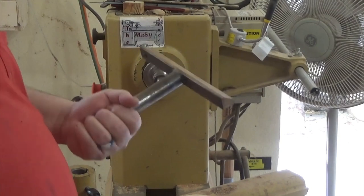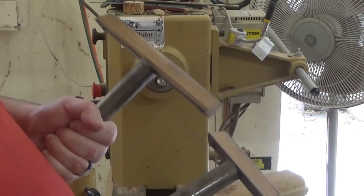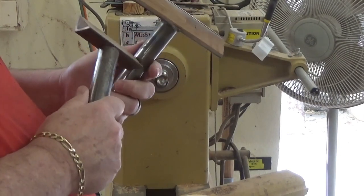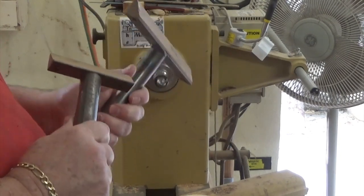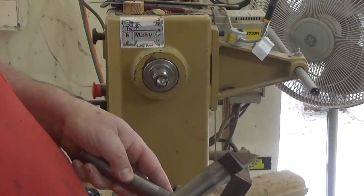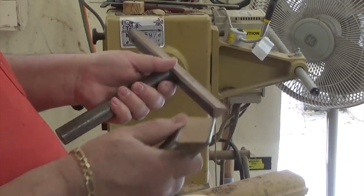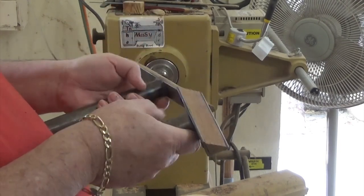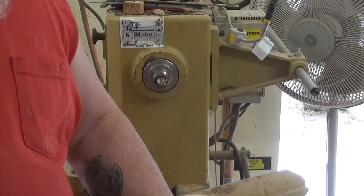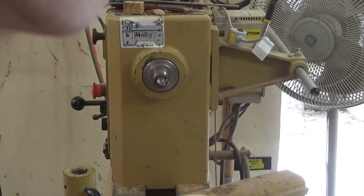I got a comment the other day on a couple of my tool rests. I've got 12-inch rests that came with my Powermatic and I've got these two that I had made by a guy who welds a whole lot better than me. When I got them it was just the one-inch bar stock welded to the angle iron — he drilled them out for me. I took some oak, cut it at a 45, took a three-quarter inch piece of oak, cut it in half at a 45, put them in, screwed them in, and they're nice little tool rests. I've got the materials to make my own — I'll have somebody do the finish welding and get them tacked where I want them.